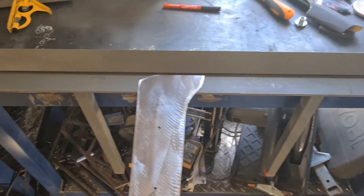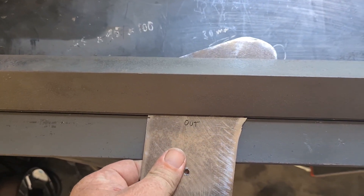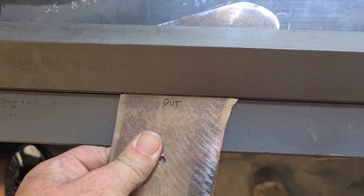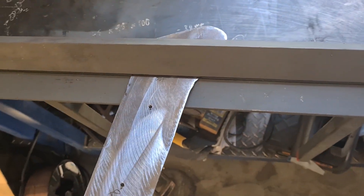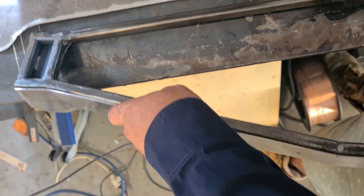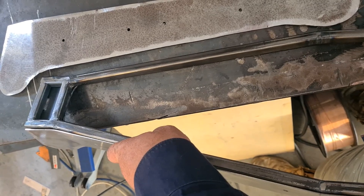I'll show how this works — I'm sliding the sheet metal in between the pieces of angle iron, lining it up with my marks, then tightening down the bolts on either end and just lifting it up. This is only 1.2 mil so it bends pretty easy. I've got both pieces bent up now and you can see it's a pretty good fit. Both sides are sorted out and now I'll figure out the bottom pieces and start building it up.